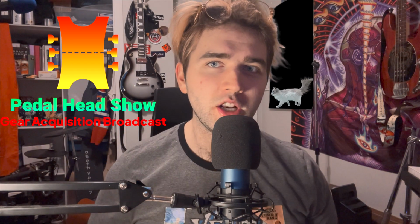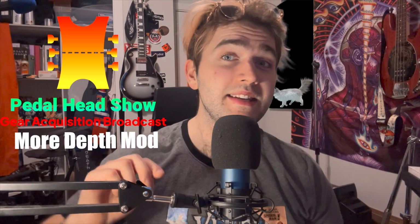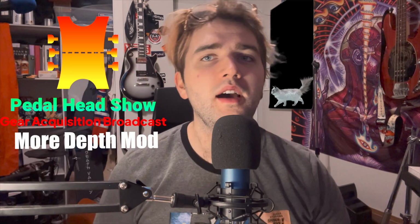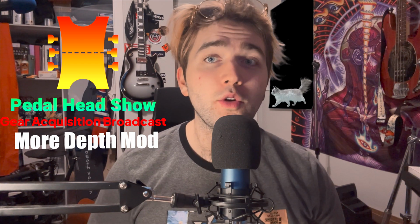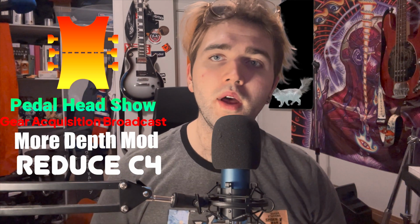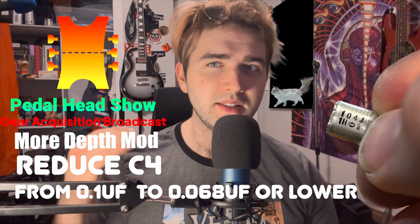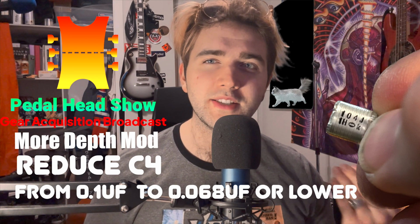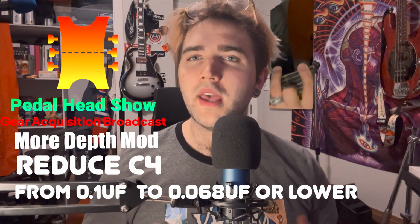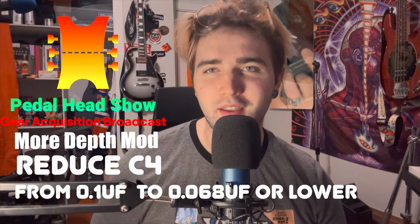The next mod we're going to be doing to the Boss TR2 is going to be increasing the depth or height of the sine or square wave by reducing capacitor 4, stock 0.1 microfarad. In this demo, I've reduced C4 to about 0.068 microfarad. So experiment with what you like. Let's take a listen to the sound example and let me know what you think in the comments.